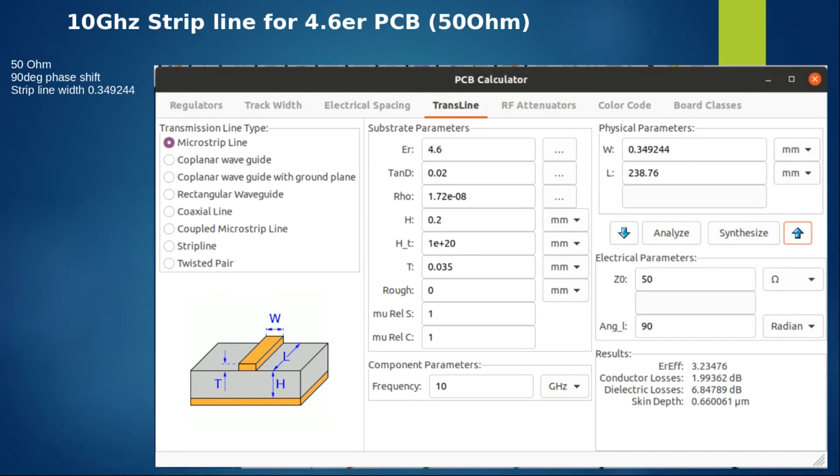You might ask how difficult it is to work at 10 GHz when we don't have 10 GHz equipment. If you have an LNB and an SDR, you've basically got a simple spectrum analyzer. Write a bit of Python code for the SDR to sweep across the frequency of interest and you have a spectrum analyzer. There are ways to do a cheap spectrum analyzer at 10 GHz using just an off-the-shelf LNB.